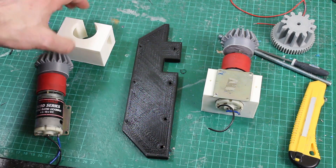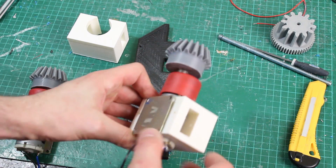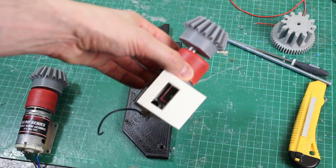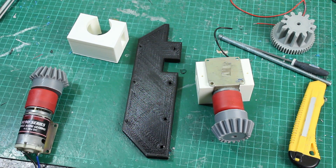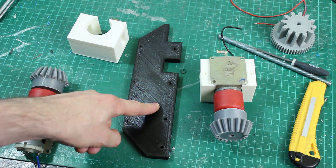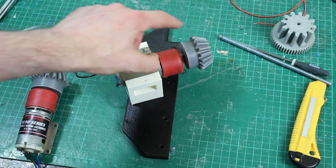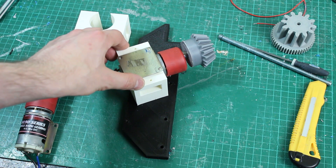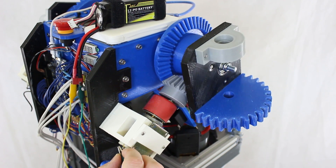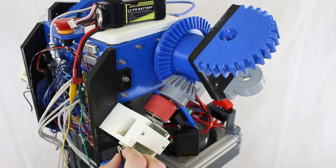I've made some motor brackets - pieces where the motor just slots in. It's actually upside down because the shaft is off-center, so flipping that piece brings the shaft higher up. These are ABS and I can solvent weld them together with acetone. I've also reprinted the side plates from the robot in ABS so I can position this and get the bevel gear angle precise with the big bevel gear. I fitted the motor, and putting some power on it gives quite a good rotation - it goes all the way round and back.